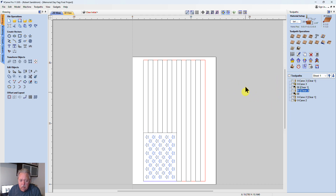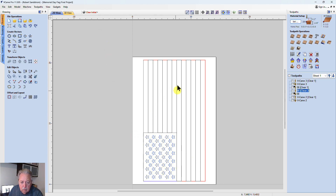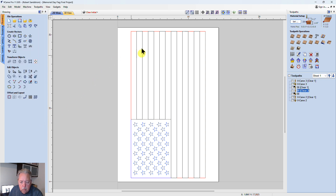I started out with an American flag that's to regulatory size. I first designed the flag so that it met the American Flag Calculator — I'll put a link in the description to where that calculator is — so I made sure the stripes and stars and everything fit the way they were supposed to. I had a poplar board that I glued up that was 21 inches by 14.25 inches, and I fit the flag by sizing it directly down onto that board so the regulatory sizes remain the same — it was just scaled.